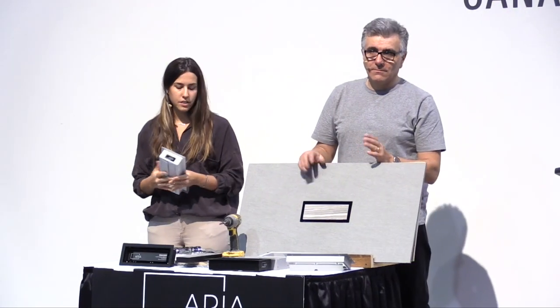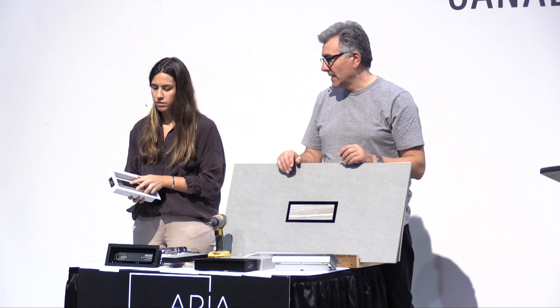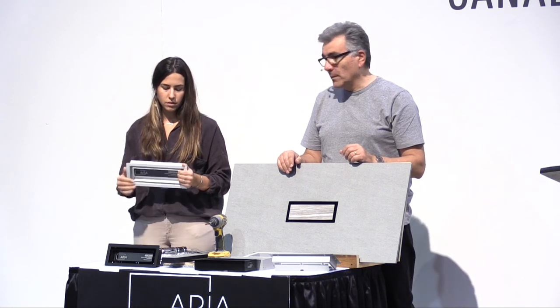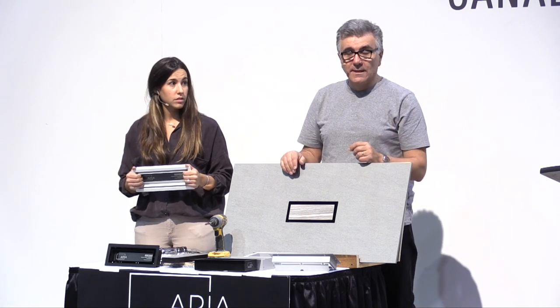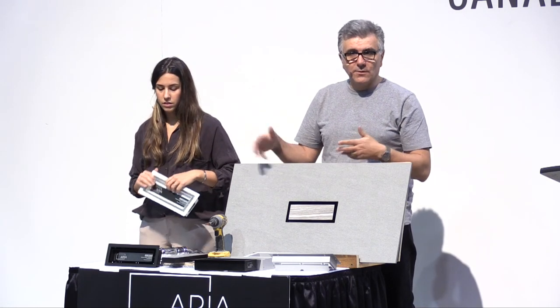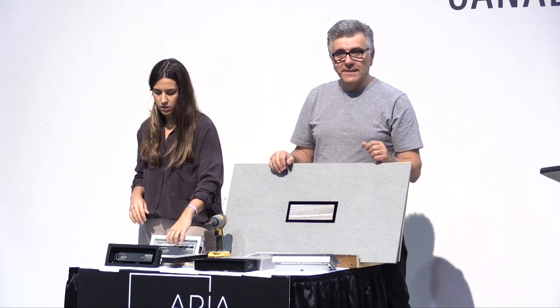You'll notice the flaps are not hinged — they're made of a softer metal. We get asked how many times you can open them before they give out: approximately 250 times. Even when they do give out, the center ones go first and the others still work. Most people adjust airflow only once or twice a year. By default, all newer vents require a damper, so this is something extra we're adding. We're also working on different sizes and a return air vent, so stay tuned on our website.